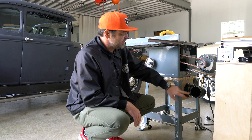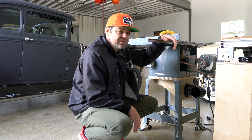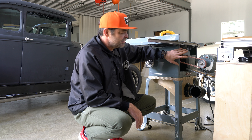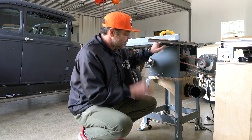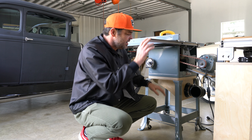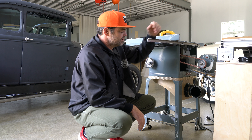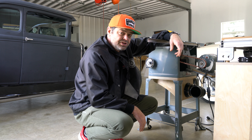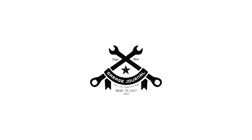One thing I did do was hook a 2.5-inch adapter up to the port and run my shop vac off the saw. It worked marginally better than I expected. Because this is a contractor saw with the big opening in the back, I'm never going to get the vacuum needed to get rid of the fine dust — it is what it is. But before I had a box under there that just caught all the big chips, and all this system is really doing is getting rid of that box and automating the process of getting rid of the big chips. For that, it actually worked pretty well with the shop vac. So yeah, I'm pretty happy. Thanks for sticking it out with me, and I'll see you next time.